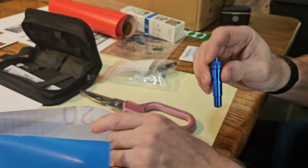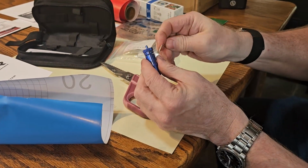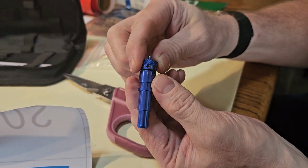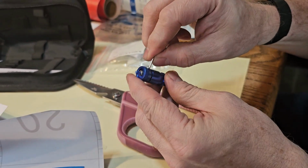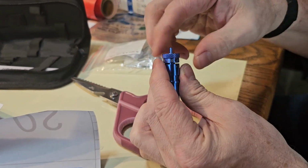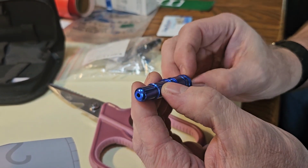Now, to adjust this wheel, it comes with an Allen key, and you have a setting here that's going to hold whatever you set up. So what I did initially was I set this to 0, and then you have your Allen key, and you are loosening up just a little bit on the inside there. What that will enable you to do is this little brass piece on here moves, and that is going to show you your depth.